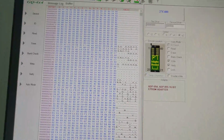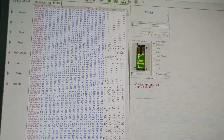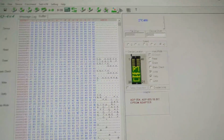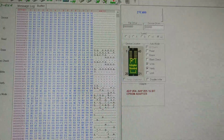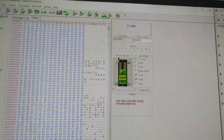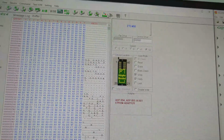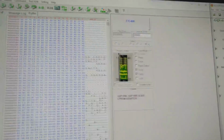Hex code is made up with 4 bits, so it can take any numbers between 0 and 15 or 0 and F that it's presented with. And because one of the bits is always pulled high, it always outputs an 8, even though it shouldn't.